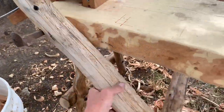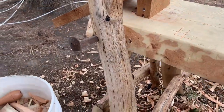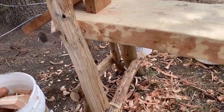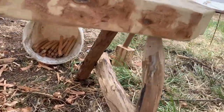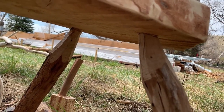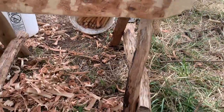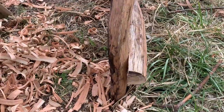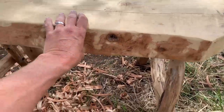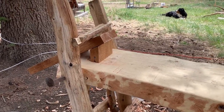I have the articulating legs pinned to the bench with railroad spikes, which I can back out if I need to do some adjustment work on it. Basically these joints here — I took the hatchet, shaved down this oak to one inch, drilled one-inch holes at an angle into the base, glued and screwed cross braces, and screwed to the legs. It's got a little bit of play but it's plenty sturdy enough for what we're doing here.